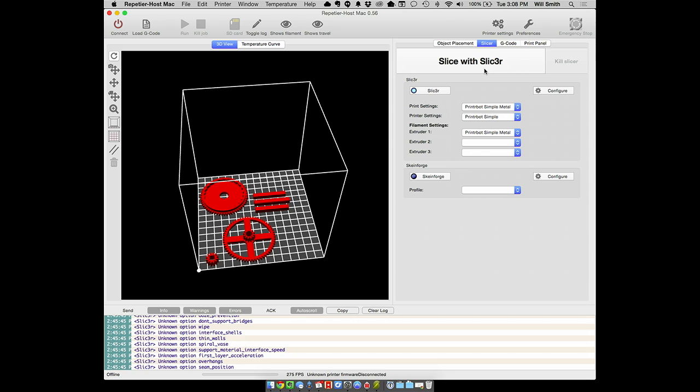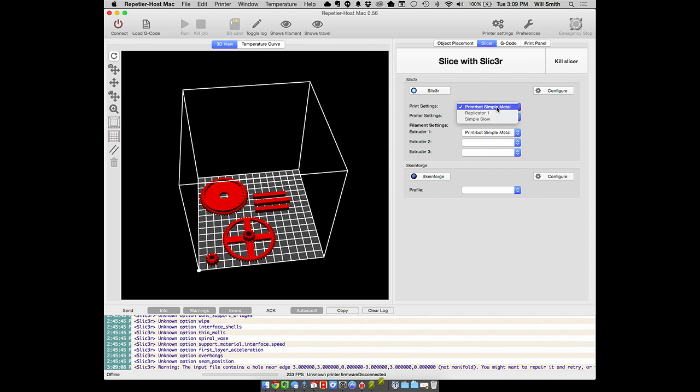Slicer is another piece of software. It's an open source, I think, piece of software that actually takes the three-dimensional models and converts them into tons and tons of two-dimensional layers of tool head movement. So it just basically says, G-code. It says here we're going to follow this path, and then we're going to go up 1/10 of a millimeter, and we're going to follow that path again. You hit the button to run the slicer. It takes anywhere from like 2 minutes to 20 minutes, depending on how big the print is. Also volume-based? Complexity? It's more about complexity. It's about how many times it crosses perimeters and edges and stuff like that.